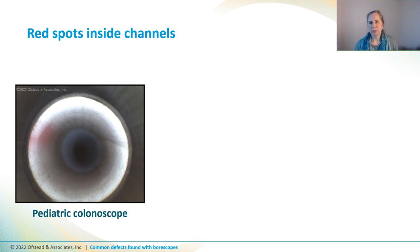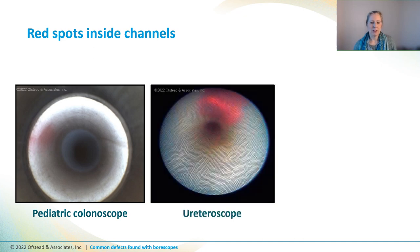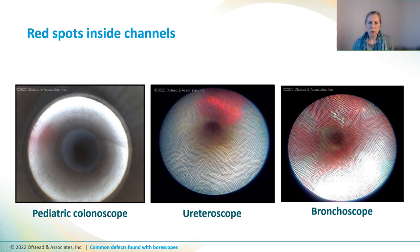We have seen discoloration that's brighter red, like this example from a pediatric colonoscope — do you see that red blotch on the left side of the picture? Bloody residue tends to be kind of brown or black, not bright red like this. We've seen similar bright red spots inside ureteroscopes and bronchoscopes. We initially weren't sure what to make of it, but then Olympus released a document saying that they mark their channels with red or black ink or dye. We've also heard that replacement channels are cut from large spools of channel material, and sometimes there's a colorful marking just inside the channel near the end so techs will know when it's running out. Although this red stuff looks really alarming, it might be just fine, and we recommend you reach out to your manufacturer or repair company if you find puzzling things like this during your boroscope exams.